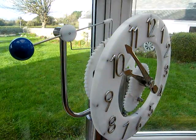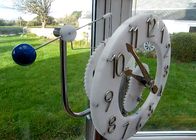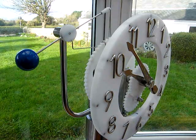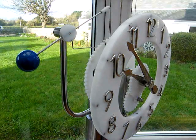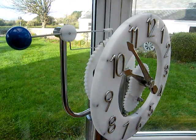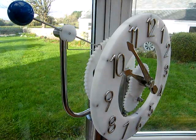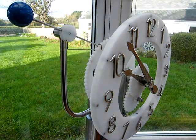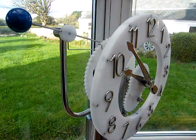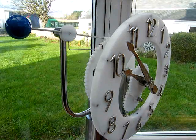This is a close-up of that mechanism showing the pushrod, the bell crank and the counterbalance weight all driving the 60 tooth ratchet wheel at the required once per minute cycle. You can see it's reaching the top of its stroke now and the siphon starts and it drops. The water level reaches the bottom, the ratchet wheel drive rod has just dropped onto another tooth and it starts the cycle again. This is all timed at precisely once per minute governed by the needle valve in the top of the header tank.